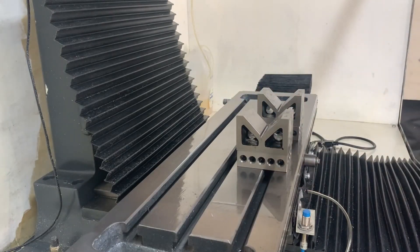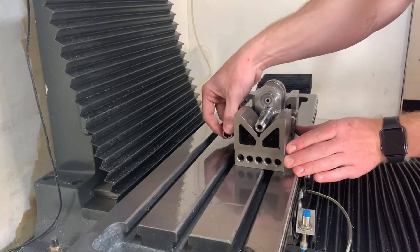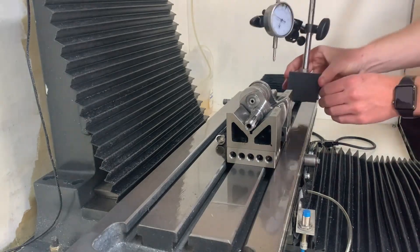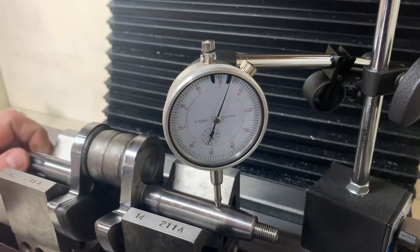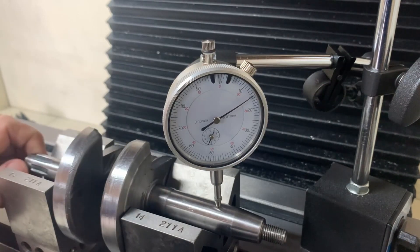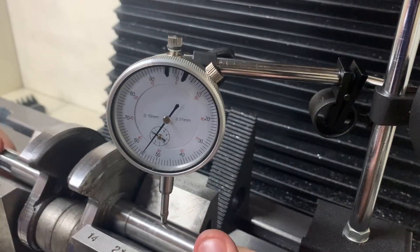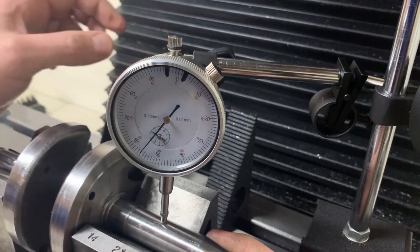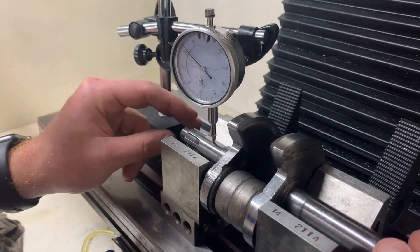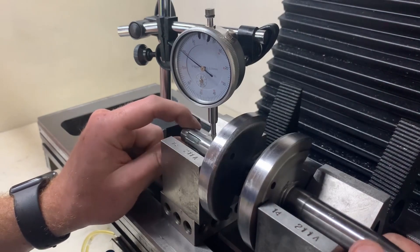Because the crank is too large in diameter I had to prop up the V-blocks on my - let's say 'ground' rather than precision ground - 123 blocks courtesy of AliExpress. From there I had to whip out the dial indicator and figure out what I was working with. The crank webs were actually pinched quite a bit. What I did was get a very short M10 nut and bolt and use it like a jacking screw to spread the crank wheels, then gave it a few sharp whacks with a copper hammer. That brought everything to within about 0.02 millimeters of total runout.